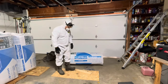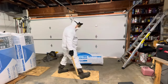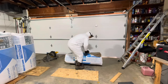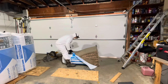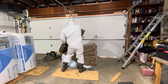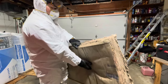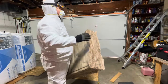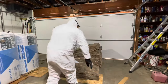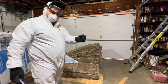You also want a board to cut against — something to hold it down so you can get cleaner cuts. And you're paying extra for this paper-faced insulation, so it's always a good idea to cut down the side and not over the top or you'll end up ruining that one piece. It's supposed to be 12 inches, so we're going to taper the edges so it fits up against the rafters up there. I'm guessing about half — maybe we'll go two-thirds and start trimming off a little bit each time.